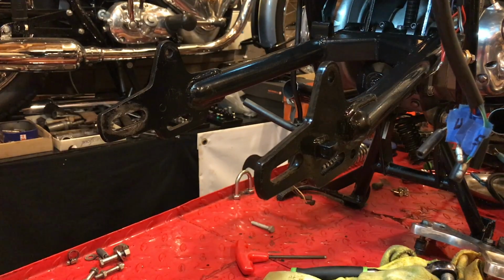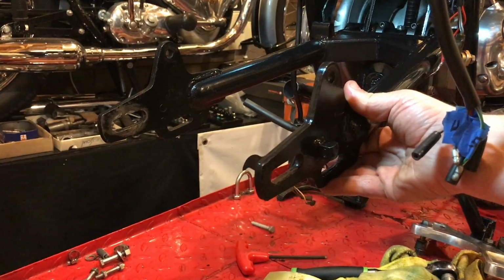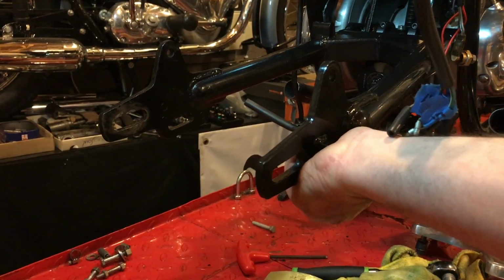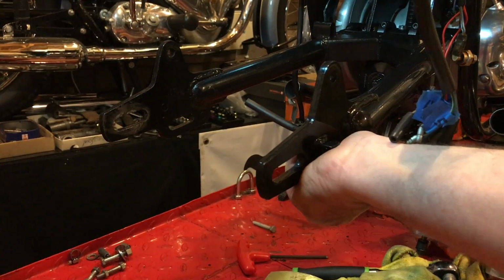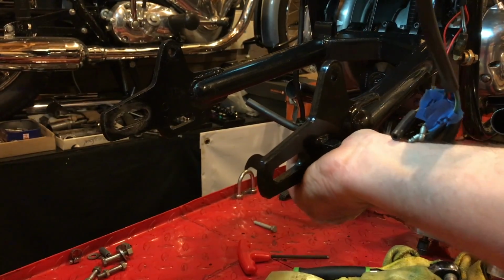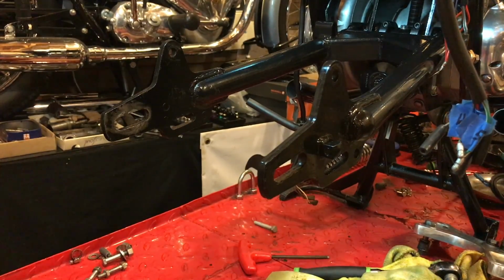And I'm just going to try and move the swing arm again from left to right with the split collar system installed now firmly. That's it, hopefully permanently. It doesn't move at all. I mean, it's probably the same, if not maybe slightly better than before. There's no squelching sound, which sort of implies that it's even tighter than it was. I'm pulling pretty firmly, and that's just my wrist moving. That's not the swing arm moving. So I would say that was successful.